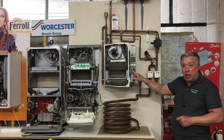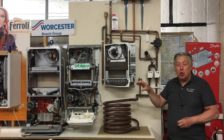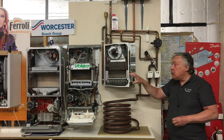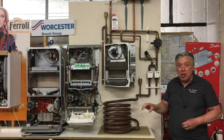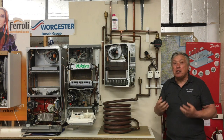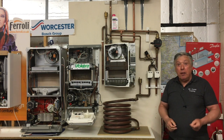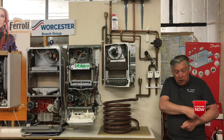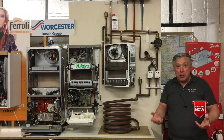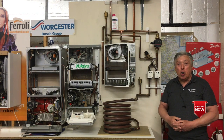If you have a cast iron boiler — for example, this Suprema — they will definitely demand an automatic bypass and the pump wired back in here. So always look at the manufacturer's instructions when doing anything with cast iron or loft installations, and you will not have the problems that we used to get and still get. If you like this video please subscribe to our channel — we've got plenty more — or get in touch through our website at mrcombi.com.